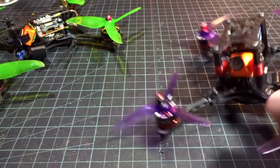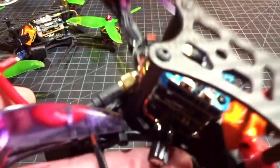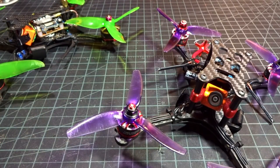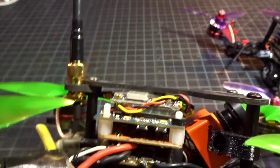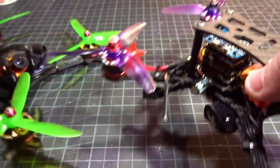As you could see in the footage, there was quite a bit of noise in the FPV video since I wired this straight to the VBat pads. I added a capacitor, but that didn't help. I would recommend powering this from a 5-volt regulated source if you can — you might need to add a separate BEC for that, which is a little bit annoying, especially on something this small where you might not be able to find a high enough amperage 5-volt source.